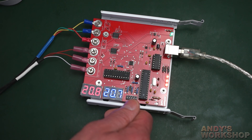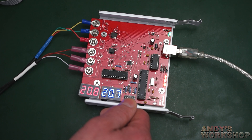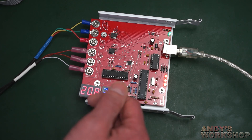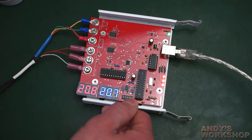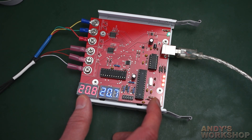You wouldn't want to put Zeners and resistors in series on lines running at multiple megahertz, but the ISP programming lines run at much slower speeds, so it's fine. It's a technique you may want to use yourself if you've got a programming header and 3.3V SPI chips on your board that don't say anywhere in the datasheet that they're tolerant to 5V — because if they're not, you could end up with damage. That's the last design feature I wanted to mention.